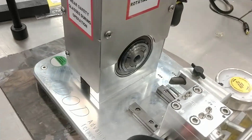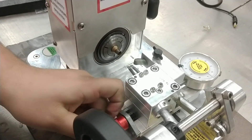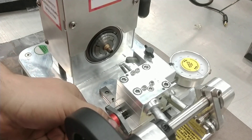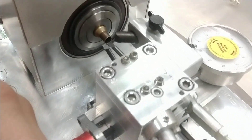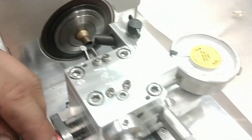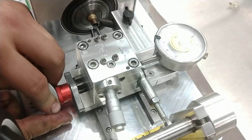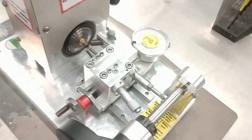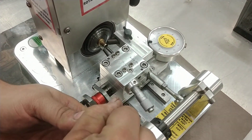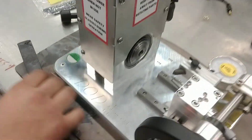We're all inserted now. We're going to put some 6.5x47 brass in and change the position of our cutter head. Looking here, we're pretty close — going to bring that back to where it just starts to cut on the inside. Now we'll make the cut. We'll measure the thickness of this.